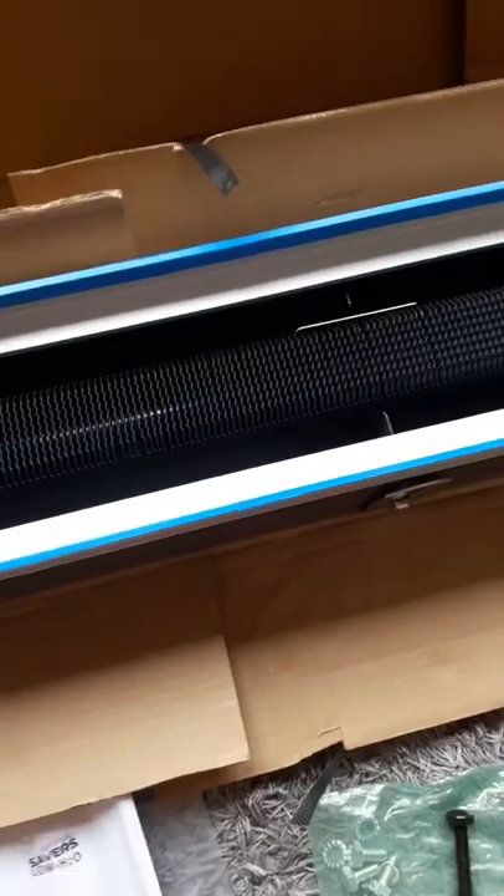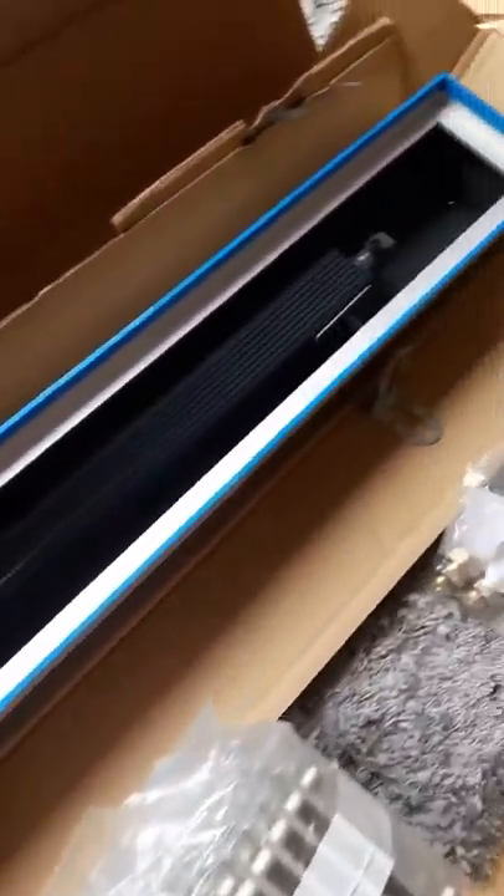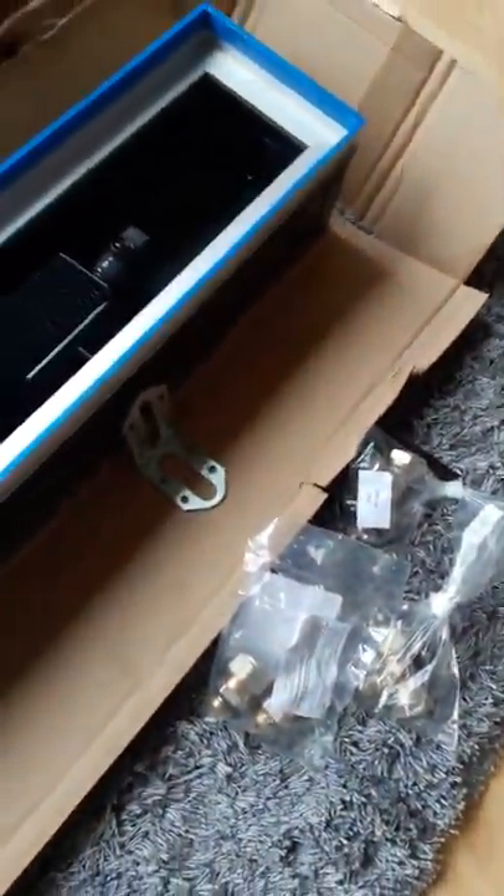This is a mini canal model. Just looking at the component parts, we've got the trench heater itself which in this instance is a straight-through unit with the pipe connections at both ends. It also has a roll-up aluminium grill, valving, and also the leveling devices.